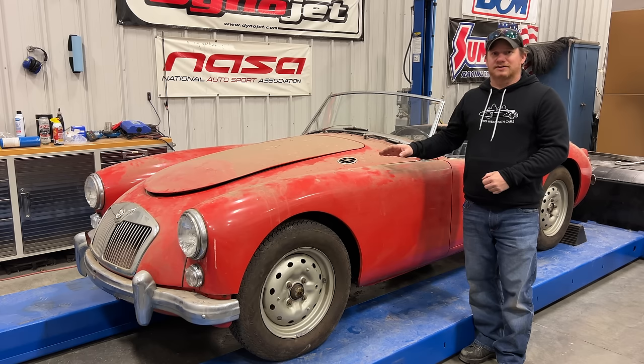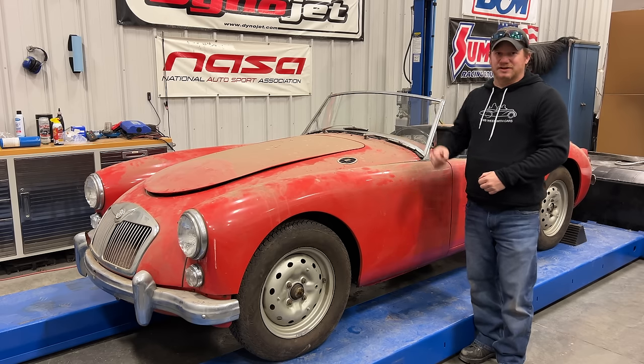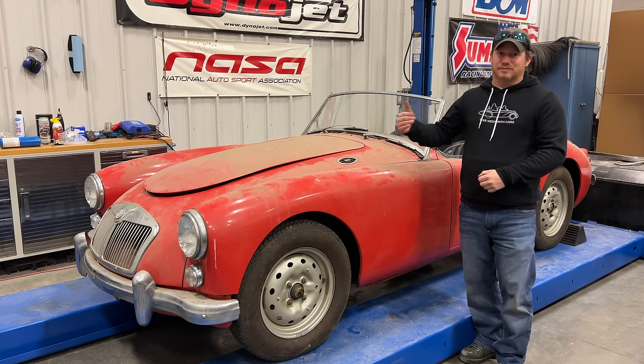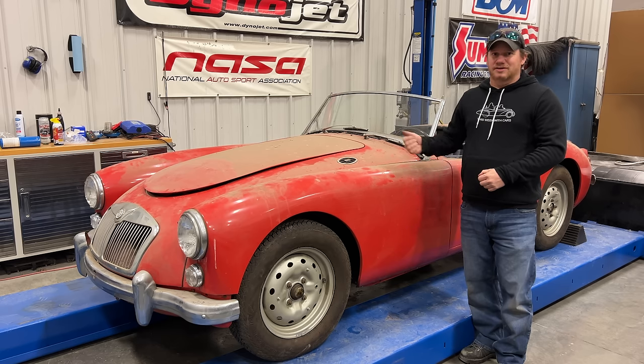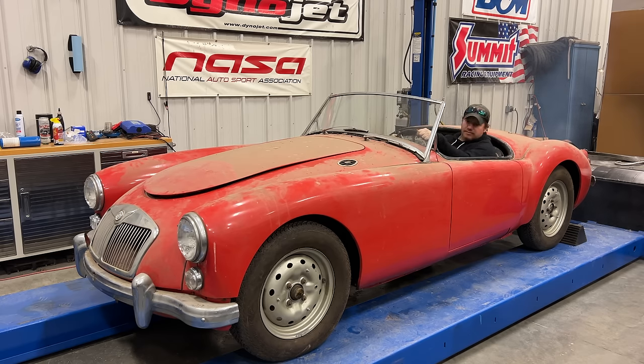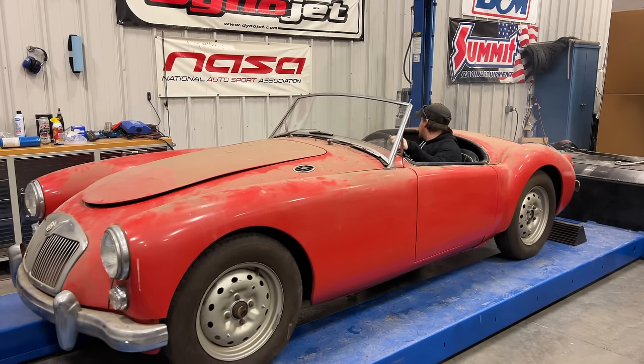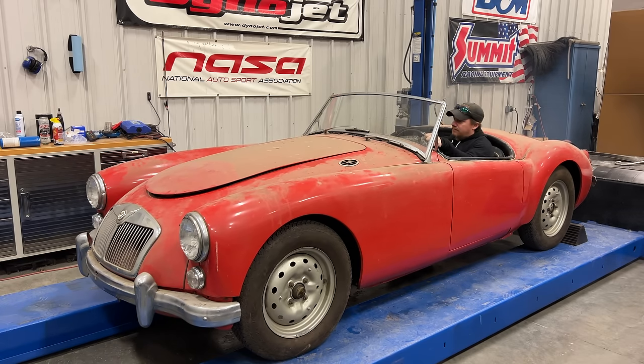This is exciting — I finally think I have working brakes and clutch on this car, and there's only one way to find out. I'm going to start it up. I put a block up there for safety, also a block behind the car so I can move it forward and back, and hopefully the blocks will stop me if something goes wrong. Well, the clutch was really touchy. You can see it smoking because I had the choke set full on right now with a pair of vice grips under the hood. But it finally moves forwards and backwards. If you want to see more videos like this, comment below and click subscribe.